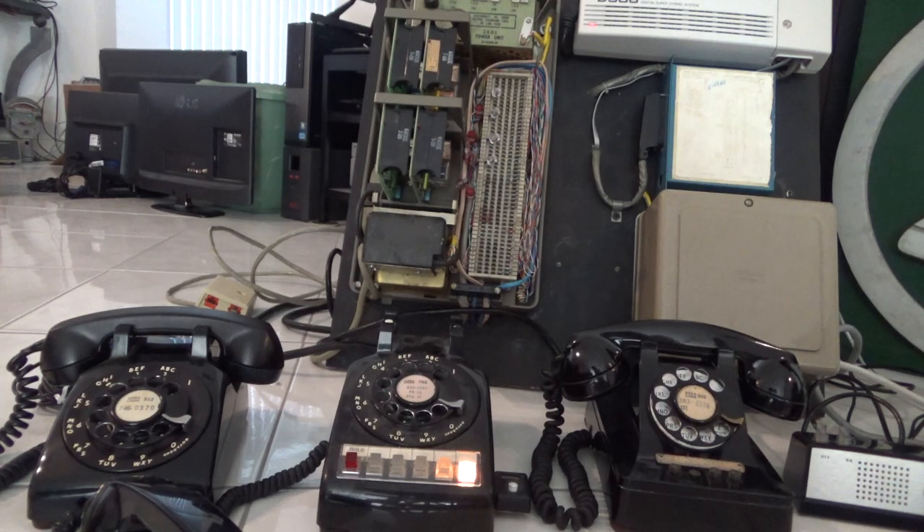This is a trick I developed in the field back in the 80s. In telemarketing rooms — what we called boiler rooms — and other areas with tables full of key sets, it was hard to distinguish which phone was buzzing. My solution was to put a 51A lamp in the hold button, tying the leads to the screw terminals that light the bulb to the buzzer — typically the yellow-orange pair. Anytime the phone buzzed, the hold button would light up so the person in a noisy environment knew it was their phone.